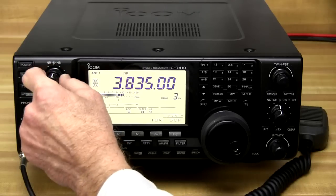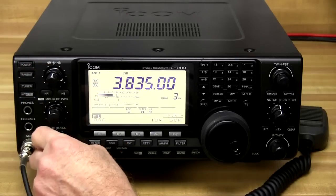There's also an adjustment for the amount of noise blanker that you're running. ICOM introduced a double-conversion superheterodyne design in the IC-7800, and an image rejection mixer for the second mixer stage is employed in the IC-7410. This receiver design not only reduces electronic complexity, it greatly reduces the number of internal distortion points compared to older triple and quadruple conversion designs.